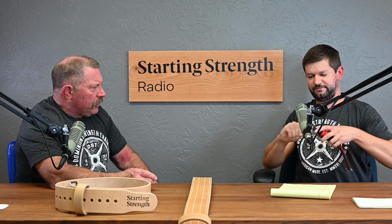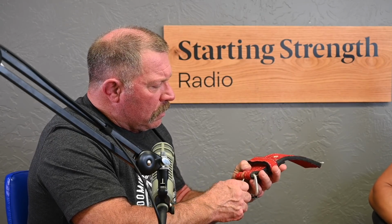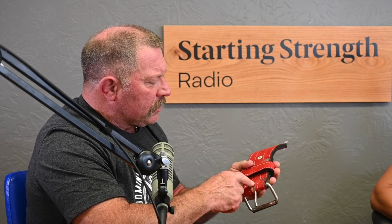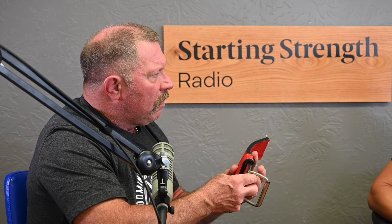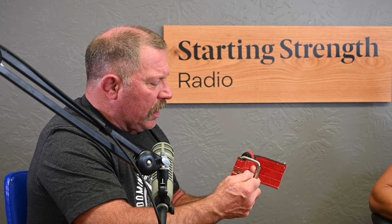I've never had one that was too tight, but I can assume it just wouldn't. It has to flop quickly, right? And if it was too tight, it would probably quickly wear out to the point where it would. Oh, here's one that's too tight. A sample. Oh yeah. Through the middle, it's not so bad, but at the extents, it's. You know why this one's too tight? They didn't cut the slot long enough. Yeah. It rotates around. It's hitting just the edge of the slot. It rams into the edge of the slot right there.